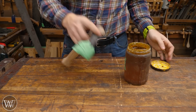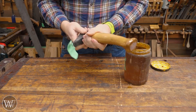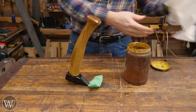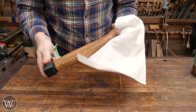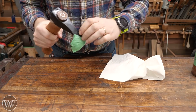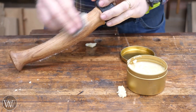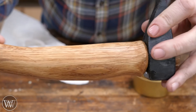Now it is time for the happiness - boiled linseed oil. There are few things I like as much as homemade boiled linseed oil on white oak. It just brings out all of the character and texture in the wood and is very, very pleasing. You'll also notice that the handle isn't perfectly symmetrical and round - it's actually offset one way or the other so that my right hand fits it. Where my pinky wraps around it's lowered a bit more, where my thumb wraps around it's lowered a bit more there, so it actually has a good fit to my hand. We do the boiled linseed oil several coats until it stops soaking in, and then I'll put the paste wax on, let it set until it hardens up a bit, and then wipe it off and polish it.